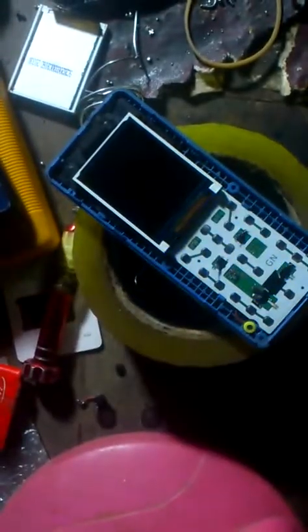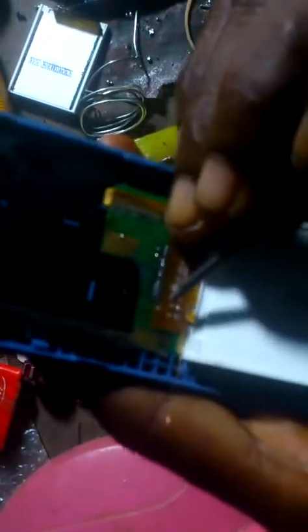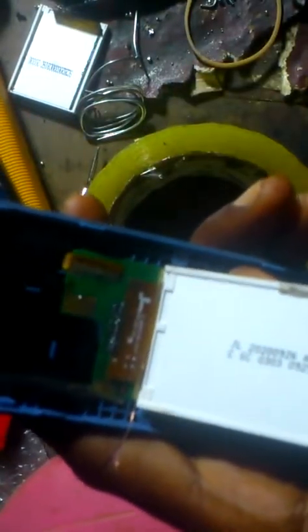Under the screen, you count one, two, three, four, five — then one, two, three, four. On the fourth one, you apply your lead and your paste so that you make a jump connection.